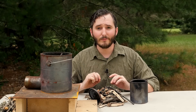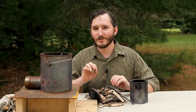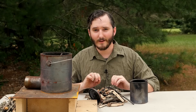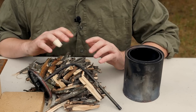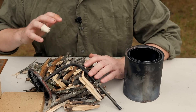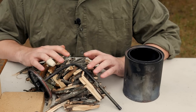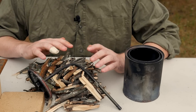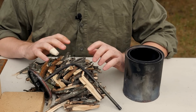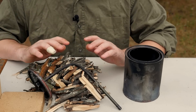In this video, I will be showing a simple process to make wood gas, and then later I might show an experimental method I've been thinking about to collect it so it can be put to good use. Wood gas is produced when any organic material — not necessarily just wood — is heated but not allowed enough oxygen to catch on fire. The heat causes the chemical bonds in the organic material to break, so you end up with methane, hydrogen, and all of these volatile compounds escaping as gas.